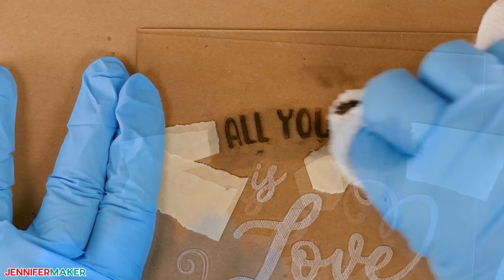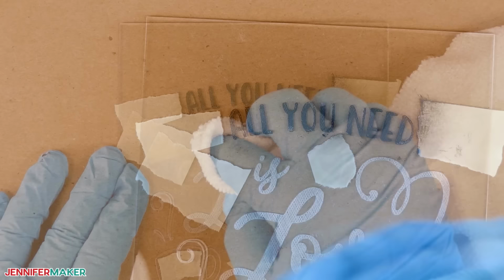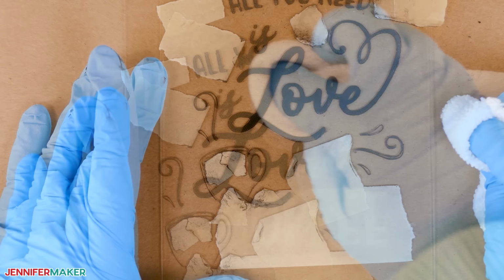When you finish a section, wipe the excess off the plain surface. The wax dries quickly, so you may need to dampen the cloth with water or rubbing alcohol to help. Keep going through the small sections until the first color is done. If any spots should be darker, add another layer before moving on.